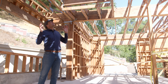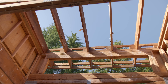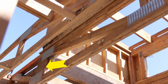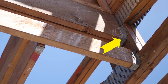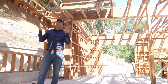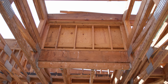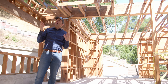Above me we have a giant pop-up in the roof — a really cool vaulted space that used to be over the kitchen, and it's important in the future design of this house. Unfortunately it wasn't done correctly. The trusses were originally designed to have this pop-up, and we can tell because they have expanded pieces of wood that form the basis for putting nails and hangers onto the supports between them. We've got big 2x12s sistered together with brackets and metal hangers below them, making a solid foundation. But right above me, they forgot all the metal hangers — the structure is just toenailed in place, and that doesn't work. You have to use all of the hardware. When I see things done a completely different way in one place versus another, and the second way doesn't make any sense, that means people weren't paying attention.